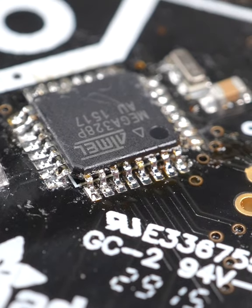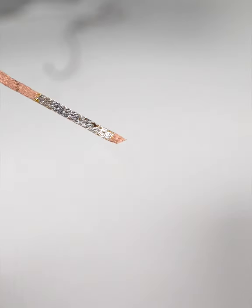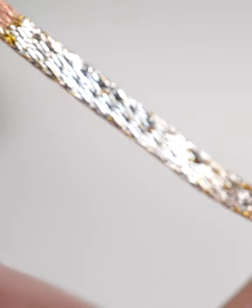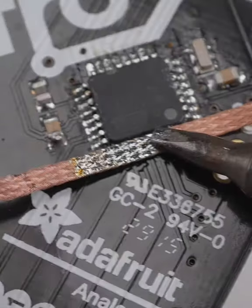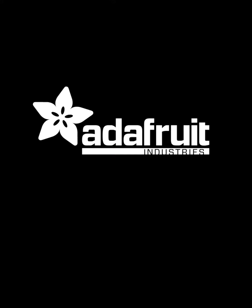After the braid cools, cut off and dispose of the used section. Like a desoldering pump, adding more solder can help keep the area hot longer, allowing it to flow easier. Above all, be patient and make sure you're heating thoroughly.